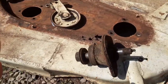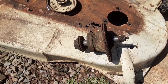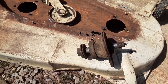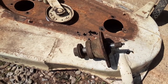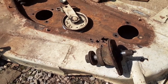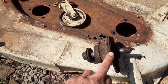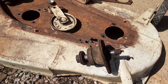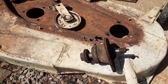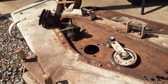These may not actually have bad bearings — it might just be that the housings are a little sloppy. This is a two-part stamped steel housing, which is what I had on my Simplicity Sun Stars and similar machines. It seems like it might be easy for the housing to wear just a tiny amount and no longer make a good fit to the bearing. I have to see if I can find a simple way to solve that, but even if I can't, it's not the end of the world — it's not as bad as the center bearing housing.